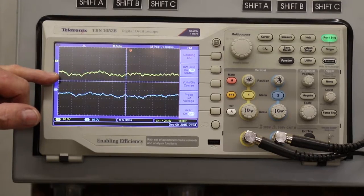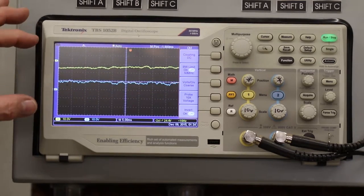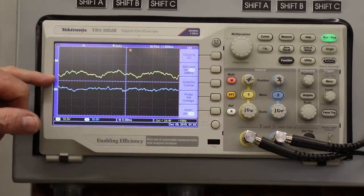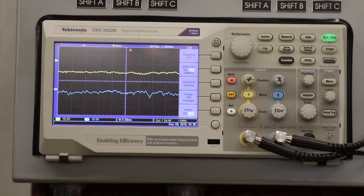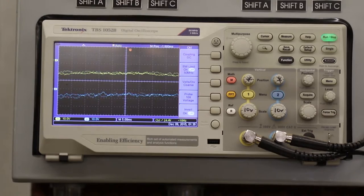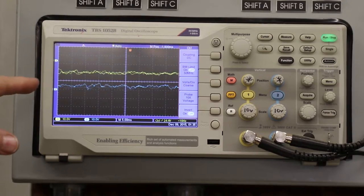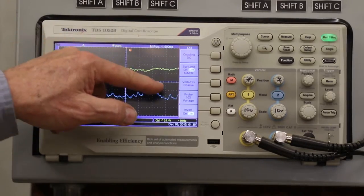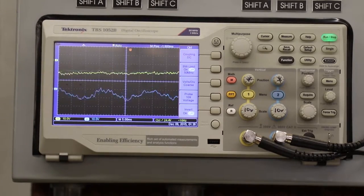If the saw would run back in the cut, you could actually see each tooth. A saw that has been welded several times — you'll see that weld coming through. The oscilloscope allows you to use your brain and see exactly how the saw is oscillating and moving. If you have a bad bearing being transmitted from the hub of the wheel, it will actually transmit out to the rim of the wheel, which transmits the signal to the oscilloscope. The oscilloscope will show a 60-cycle sine wave of a bearing pattern, telling you that you've got some bearings going out.